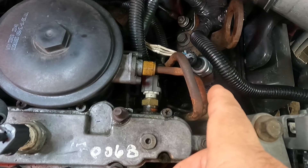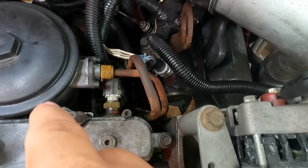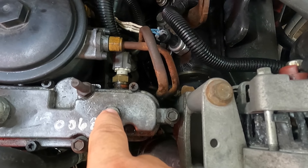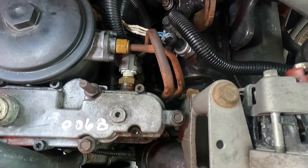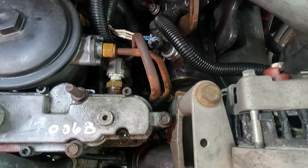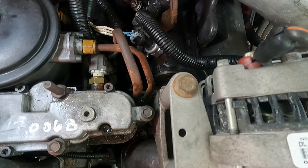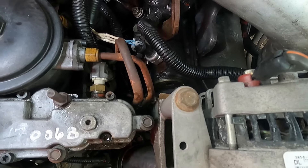We found no oil in the reservoir and a little low oil in the oil galleys under the ICP. We didn't check the other side since the galleys weren't terribly low. We bottle-fed it, got it full up, and let it sit for an hour or so — it doesn't appear to be going down. We tightened up the cap on the reservoir and we're going to try and see if she'll go. If it happens again we'll have to dig into the oil passages — the check ball behind the alternator, the timing cover, or the low pressure oil pump.